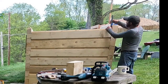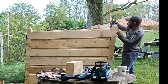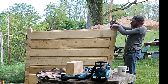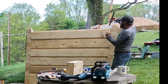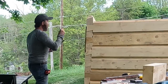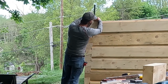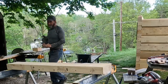What I'm doing is getting a measurement from the top of this angle down to the top of the board, but leaving just a little teeny air gap, because you don't want the weight sitting on top of here — you want all the weight on the corner. If it happens to touch somewhere along the way, I'll just have to shave it. This side and that side are done differently because these angles aren't perfect. This one's off by about half an inch from the other one.